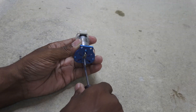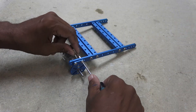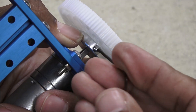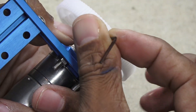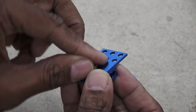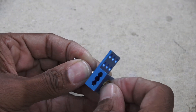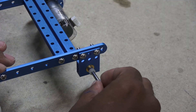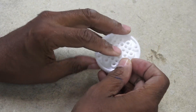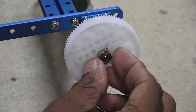The motors are screwed to mounting plates and then to the subframe. The gear drives are held on with set screws to an adapter plate. Axles use flange brass bushings — I like that all the axles use these. Ball bearings would be nice but probably overkill. A shaft collar holds the wheels in place.